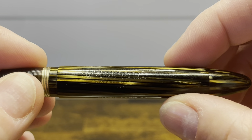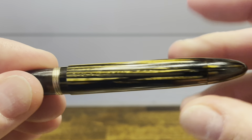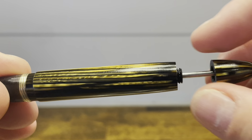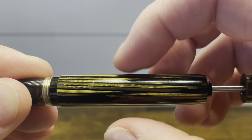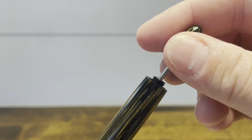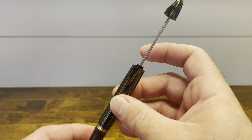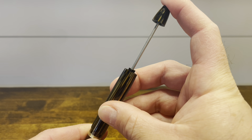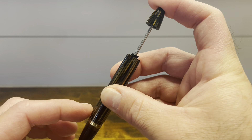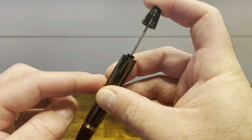Right at this point we start seeing a taper going down to the end finial. If I give the end finial a twist, we can see that it doubles as a piston knob. Pulling that piston knob back, we can see a metal rod which inside the pen is connected to a rubber seal. Pulling the rod all the way back will allow us to fill the pen. If I put the nib into ink and push down on this rod, it will create a low pressure system behind the piston, and at the bottom of the barrel we have a flare out which breaks the seal and allows ink to be drawn into the barrel.